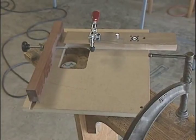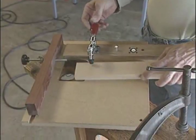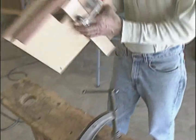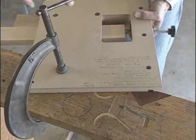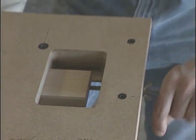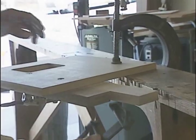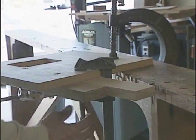This is my jig upside down. The fence is perpendicular to the work edge of the window template. In goes the first of 2 pieces to be lap joined. The screw with the black knob sticking out on the right will let me locate the scribe line right at the edge of the window. One clamp is not enough. The cutter's forces on the work can dislodge it as you work from side to side.